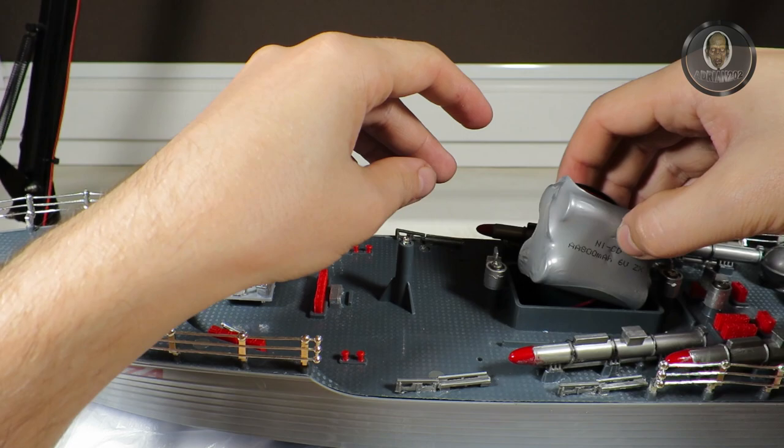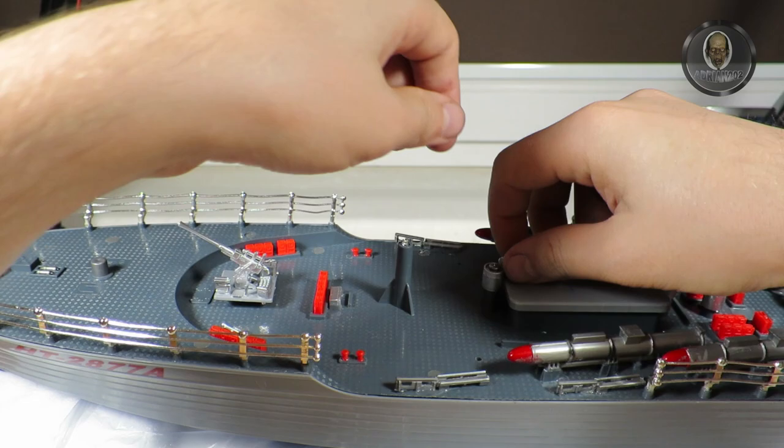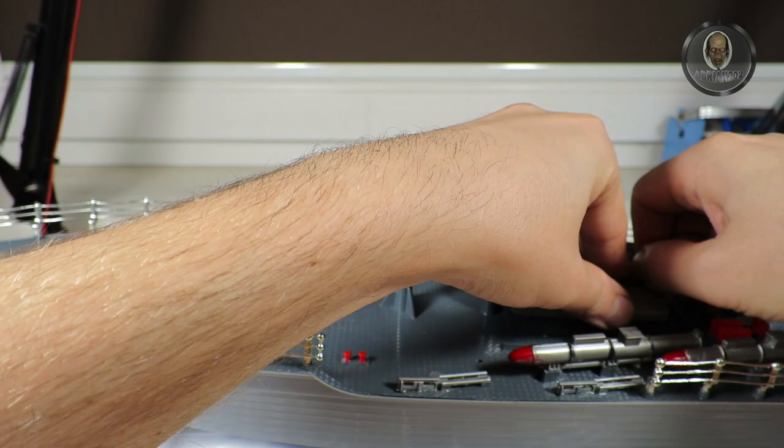For this battery you need to discharge it before charging it, because those batteries don't like it when you charge them when they're not fully discharged. That's why for Ni-Cd you can always find a discharger.